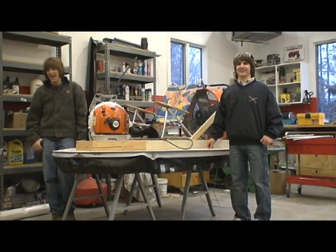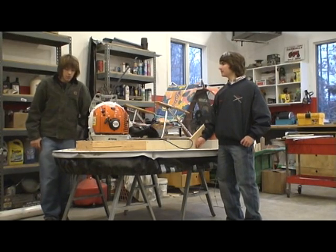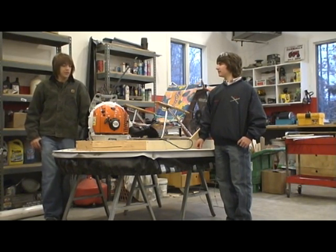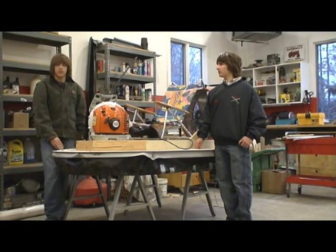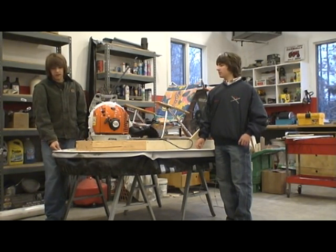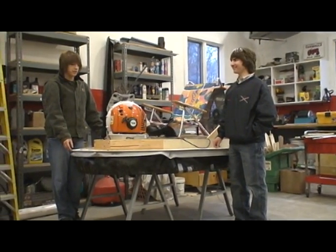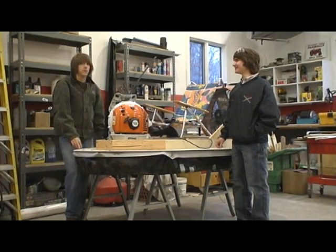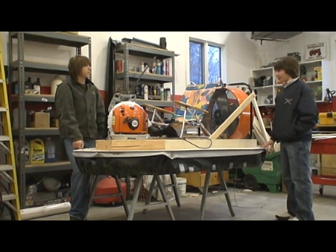After a month of working on our hovercraft, we have had our first successful test run. We came across several problems with the skirt. The main one was that the material is thick, so it bunches around the edges and that allows for pockets of air to leave, which takes away from the efficiency. Since the craft skirt is made from vinyl, it's not very strong and it actually ripped in the back — the seam ripped.